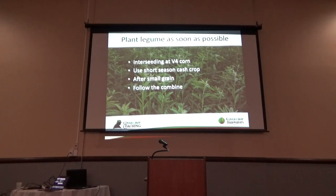So we talked about different ways of doing that. There have been some people put cover crop seeders on combines, where they actually take the seed and put it underneath the snouts. So when the corn comes down, the cover crop's underneath there, and it's underneath the fodder. Not a bad idea. Soybeans, put it on right behind the head on the front with deflectors, blow it out there, and the residue comes out the back, covers it up. Corn chopper, if you can fit it on there, probably custom operators don't want to stop for 5 minutes and reload every hour. I know custom operators like to run, and it's full speed ahead. Don't stop for anything, so I get that, but just saying that these are some options that are out there